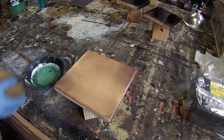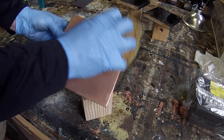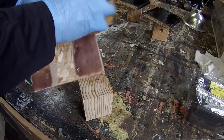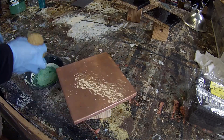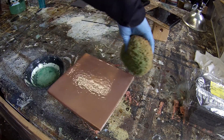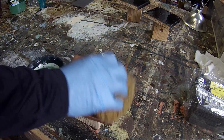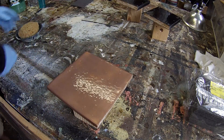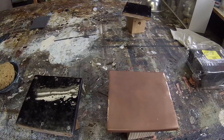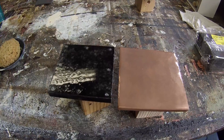Now I'm going to apply the same solution to the copper sample. Copper is not as sensitive as zinc — applying too much or too little solution isn't as critical. You won't get an immediate reaction; the patina will develop after about five or ten minutes. You might want to go over it a few times at different intervals. Sometimes really dark spots will start to form, and sometimes you'll get different colors. It's unpredictable with copper — I never get the same result twice unless conditions are identical. Wintertime patinas look different than summertime patinas.